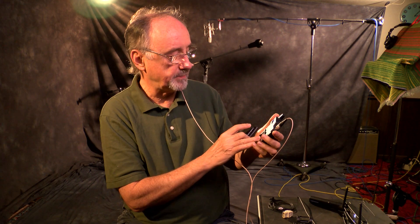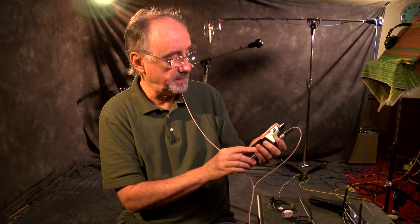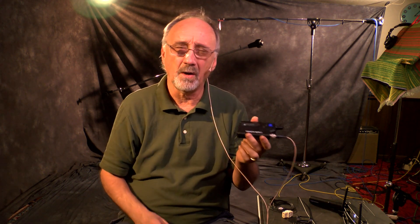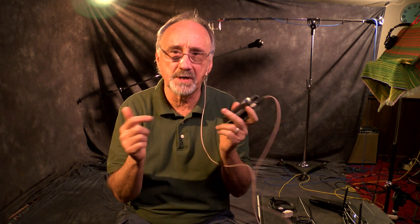We've got a couple of AA batteries, a pair button, and a little tweak stick that helps us move the sensitivity level of a body mic. This is the Audio-Technica System 10 digital wireless. It's running at the 2.4 gigahertz band, which is where Wi-Fi is. Audio-Technica has figured out a way to have the transmitter and receiver talk to each other constantly in a duplex situation, navigating the holes through Wi-Fi without it being audible when switching, in order to keep a constant connection.